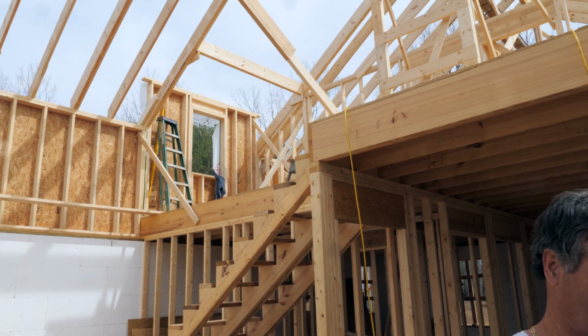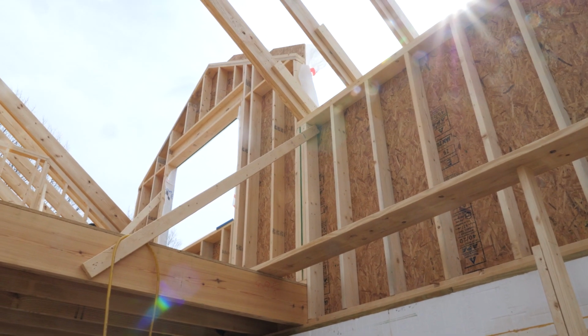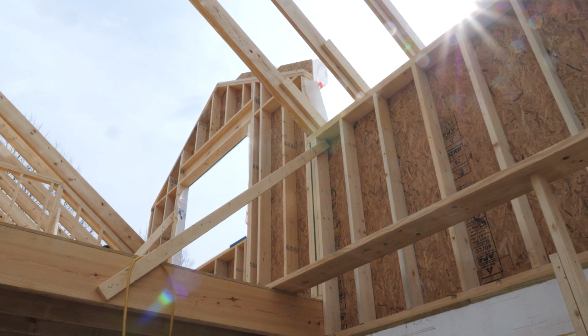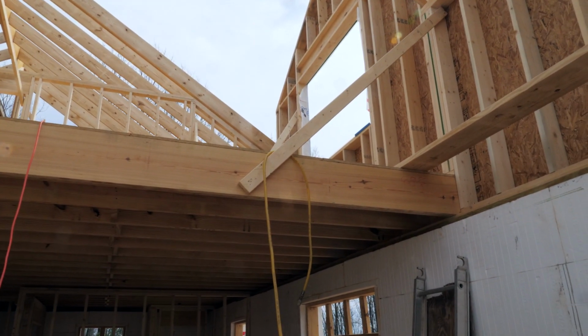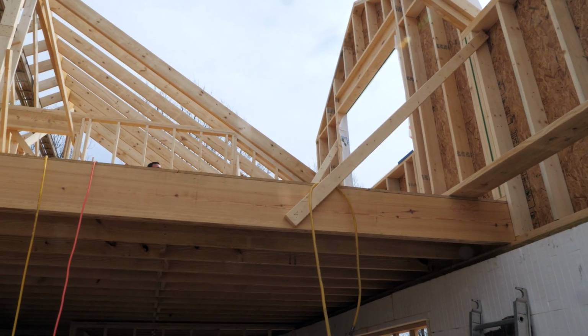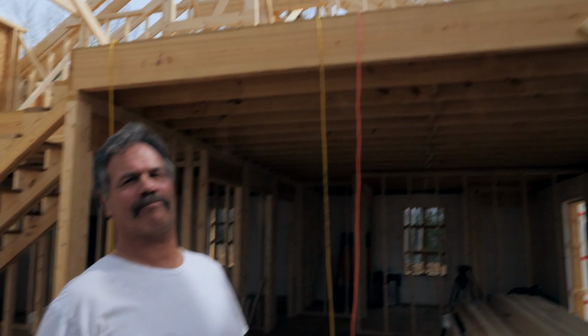That's going to be a bathroom, so we wanted a ceiling there so you could fit your vents and lights and all that in it. And this one up here does not have a ceiling. It's vaulted. So that changes how you build the roof. They're going to have to start sheeting from the bottom there up and get to a certain place before they can finish framing this out. Is that right? Does that make sense?